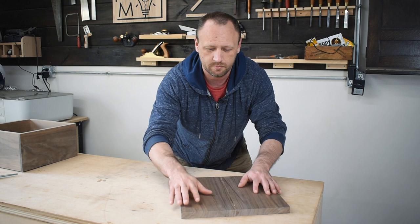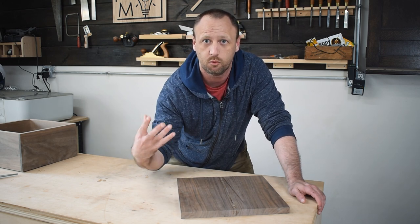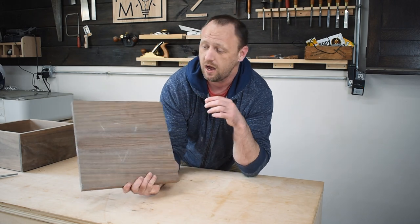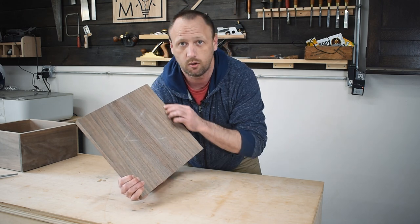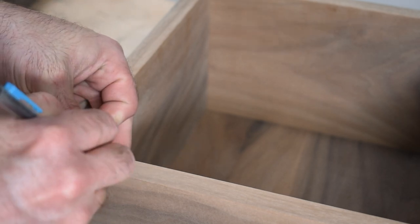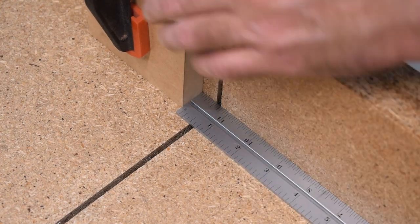That's the reason why we want it to sit — now we can re-mill it and we know we're going to get super flat boards. I took the lid out of the clamps and it is dead flat, much different than when we first milled it and let it acclimate to the shop. It had a slight bow after it sat there releasing the moisture, that's why we re-milled it. But now it's flat and ready to go. As far as getting this to fit onto the box, I'm going to do rabbet joints — cutting rabbets all the way around the perimeter over the table saw using a ripping blade.